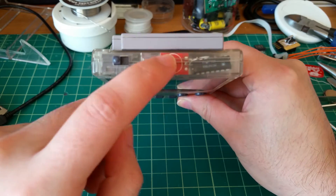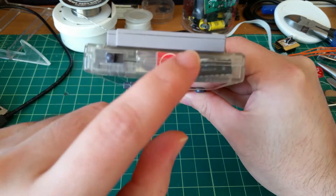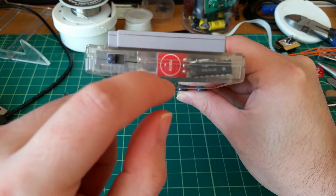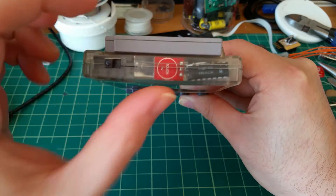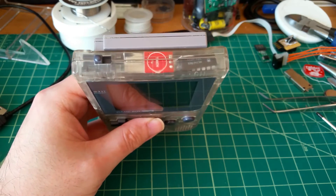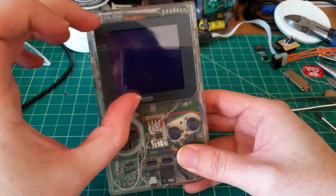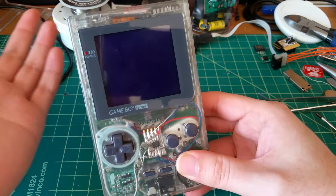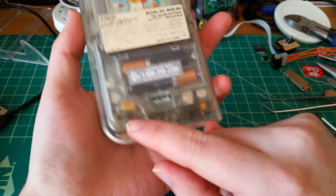The color that comes up on the screen is normal to your eyes but higher contrast. The touch sensor barely fits — there's a little bit of a gap and the power switch wiggles because of that. I could shave maybe a millimeter off the sides to get a tighter fit, but this is just proof of concept. This is the touch sensor to change the color. There's still a bug where when I turn it on it automatically changes the color once on boot even if you're not pressing the button — that might have to do with a power-up issue.